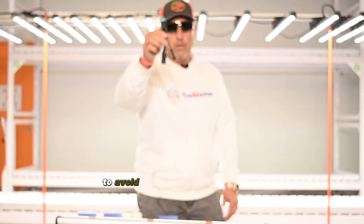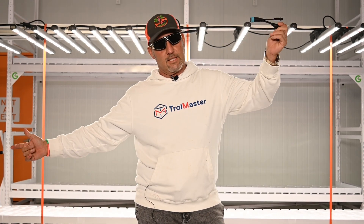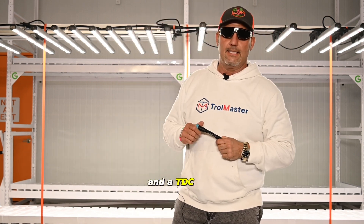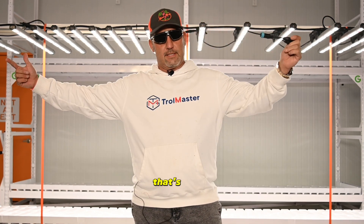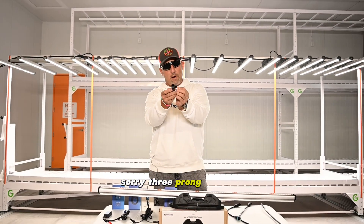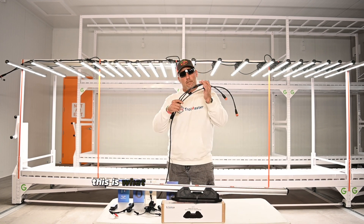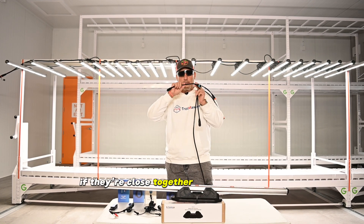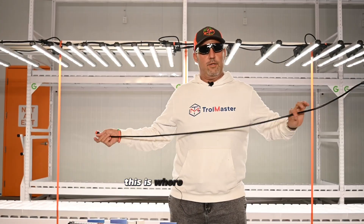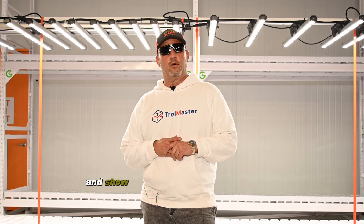This is the TDC — this is what you adapt to the power cords and the daisy chain cords to avoid having an electrician pull outlets. It comes in a six-foot or ten-foot cord: a TDC-120 for 120-volt and a TDC-240 for 240-volt. It has a three-prong power-in and communication cable that all turns into one. If lights are close together you use the 12-inch connector; if they're farther apart you use the two-footer. This is where you connect the top lights to your ICLs.